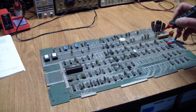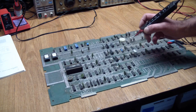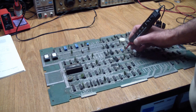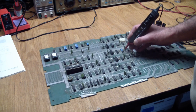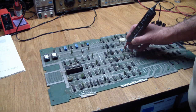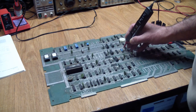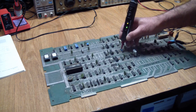I found another weird chip — a 7404 inverter. We all know how inverters are supposed to work: input low, output high. Okay, but that's where it ends on this one, because all the other gates on it show a low input and a low output — repeating itself all over. So this chip is bad.